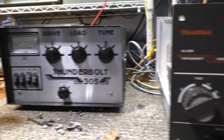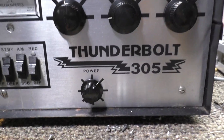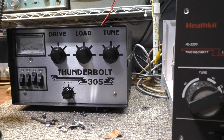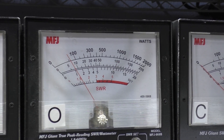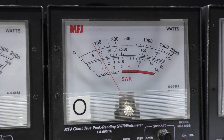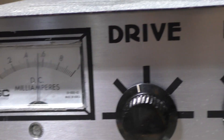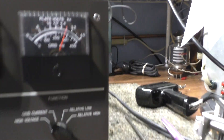On a dummy load, we're using this Thunderbolt 305 for a driver — that is so long gone, we're gonna pack that up. We were testing it and thought we might as well use it as a driver. Even though it can do 300 watts, it's got a variable power level, so we got it back down. Using the watt meter here on the 2000-watt scale, the Thunderbolt 305 is doing about 40 watts, swinging about a hundred on audio peaks. That's the plate meter of the Thunderbolt 305.